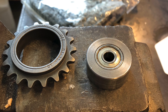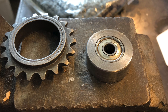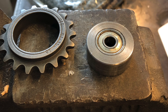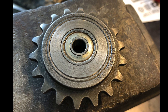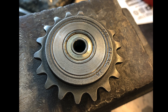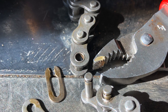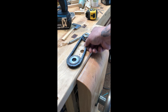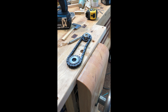Now, those sprockets are hardened, so I couldn't really manipulate those easily. That's why I made this combo bushing-bearing that would press inside. I don't really remember where I got the chain and sprocket, but it's pretty available online — you can find chains and sprockets easily. Here you can see it pressed into place, then tack welded. The chain I just ordered in length, and of course it had a master link. Once the two sprockets were complete, I calculated a link count that would fit on the machine and made an assembly, anchored it to a four-by-two and tested it out.